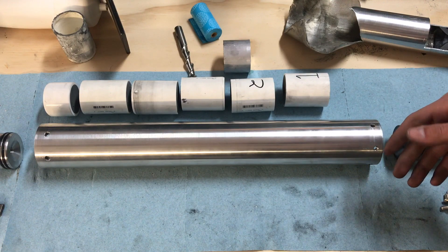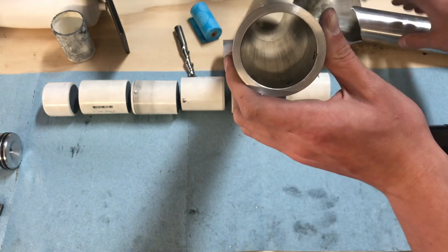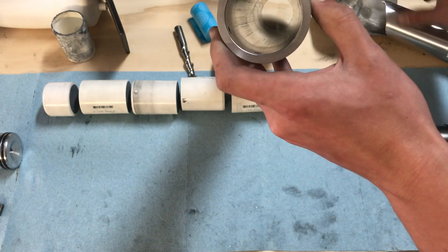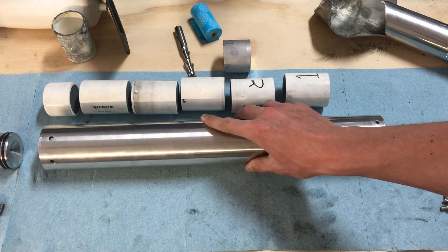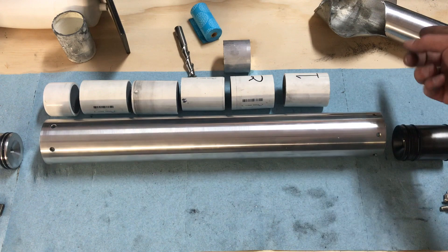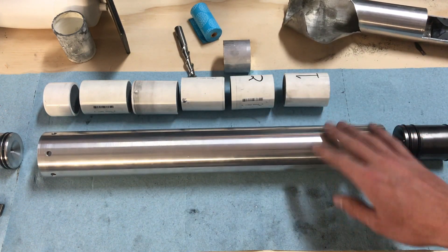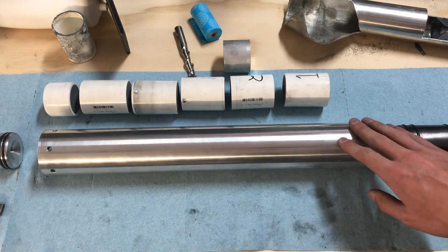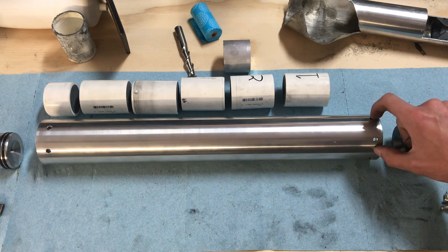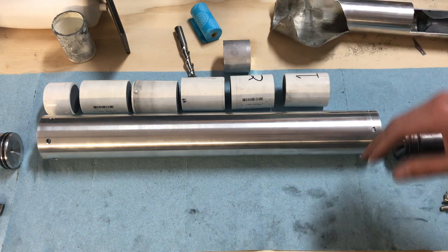Because it's bigger, it's obviously a higher pressure motor. This motor was designed to be a lot higher pressure, and this is evident in the wall thickness of the casing — it's more than three times the old one. The baseline operating pressure is about 1,100 psi, a lot higher than the old one which was only built for around 500 psi, and even still that casing was a bit thin. So we didn't want to take any chances with another rupture. The casing has holes in it, unlike the welded bulkhead and threaded design of last time — I'll go into that design decision in a sec.